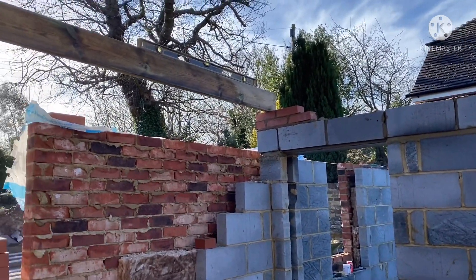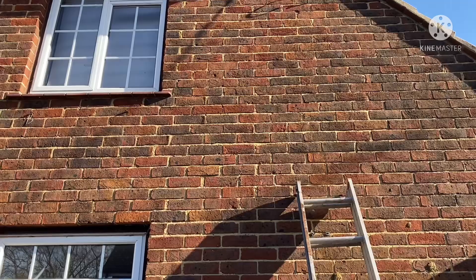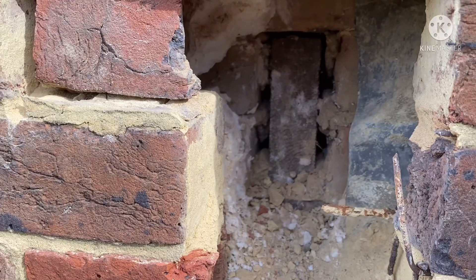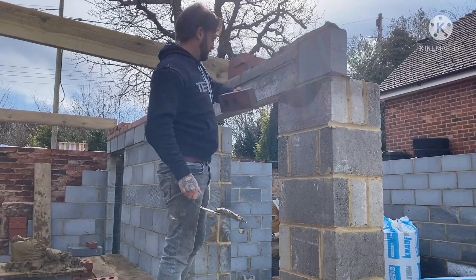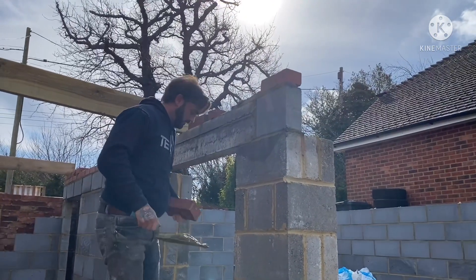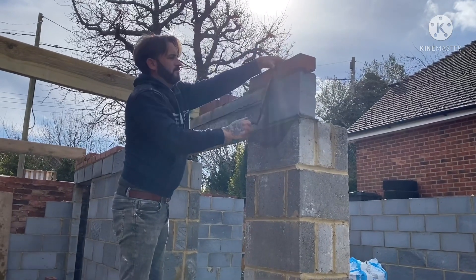We know now that's our height, the underside of our joists, so that marries up with the floor up there. When we knock that out, all that wall comes out and then it's a walkthrough, so you've got to make sure your joists are level with inside of the house to the extension. We've punched a hole out of the wall there, and that is the joists inside — floor joists — so that shows you what height you want your floor joists going out into the extension.